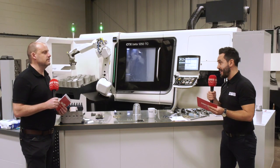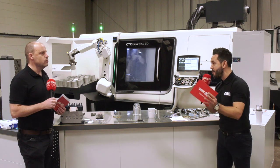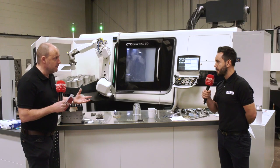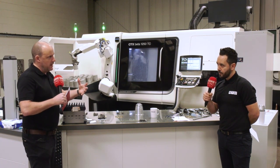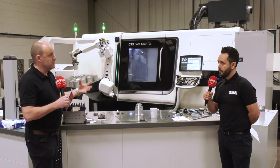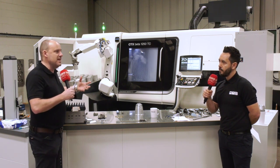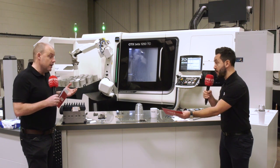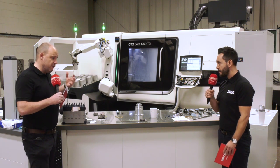Programming a complex machine with milling capability is a massive consideration. Now, the milling head — this is a mill-turn but it doesn't lack power. It's very capable on the milling side, like a machining centre if not better than some: 20,000 rpm with a direct-drive milling spindle and HSK 63. The key point is it's very compact — almost as tall as it is wide — so when you tip it through 90 degrees you're not taking up much of your working envelope, giving you more flexibility and the capacity to hold larger components in both spindles. It's a 1250mm turning length with quite a bit more actual holding capacity — all about flexibility, power, and speed.